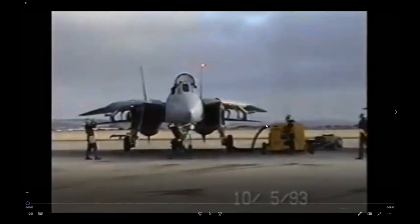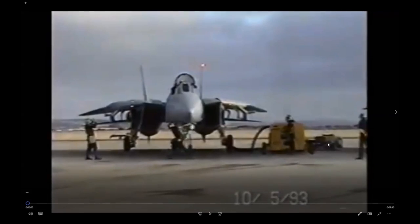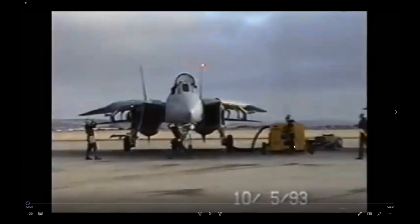The other thing they've got here is a compressed air source. The huffers are attached to the tow tractors on the beach. If you're lucky, you have a ground power unit that also supplies compressed air. If not, you have to tow around this huffer to get your compressed air. Regardless, you need AC power and compressed air on the Tomcat.